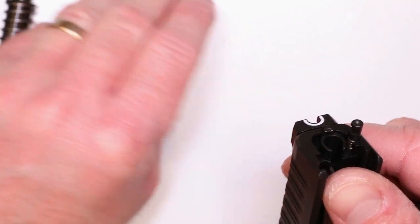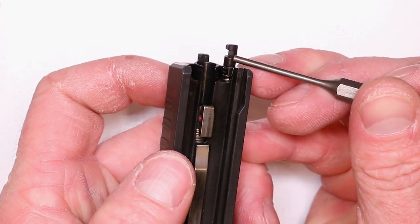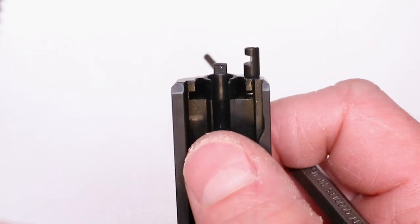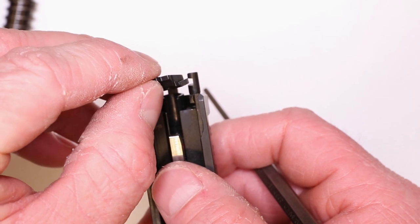Keep your finger over this striker sleeve to keep everything together and avoid it exploding on you. There's the back plate — set that aside. Immediately you'll notice on this extractor plate there's a cutout. So when we go to put it back together, that cutout is intended to slide into the back plate like this — that's what locks and keeps it all intact.